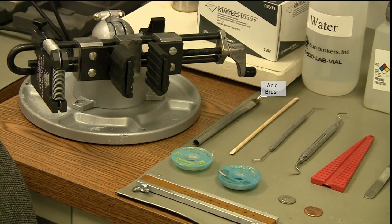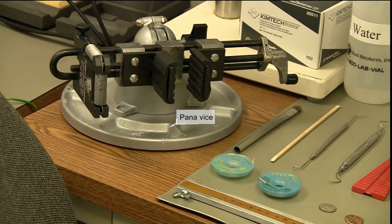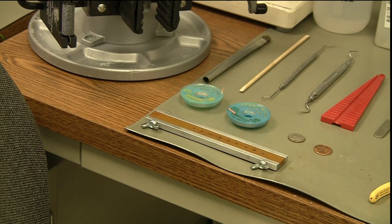There is also a brush referred to as an acid brush — it's ESD safe. We put a little alcohol on it and scrub our boards with that. Further to the left is a vise called a panel vise, used to hold boards into place so you can work a little freer without it moving around on your tabletop. There is another style of vise below the two blue spools — it has a set of wing nuts, and I use this for terminals and sometimes holding wires into place.